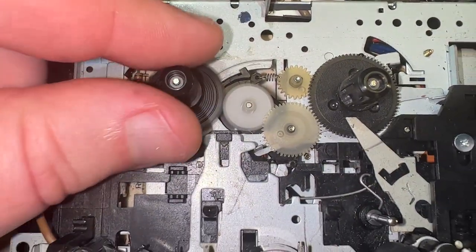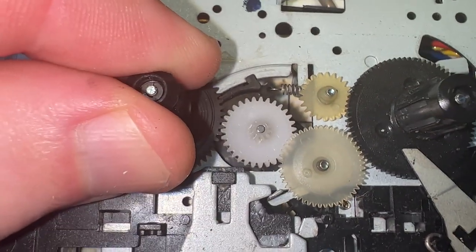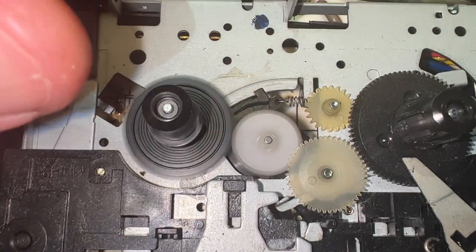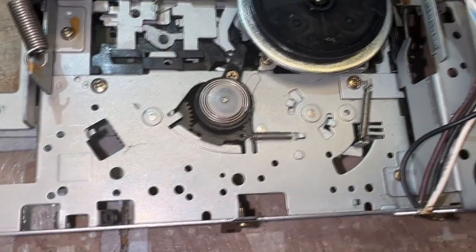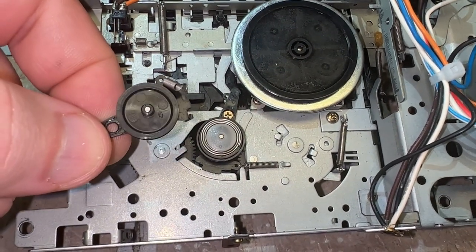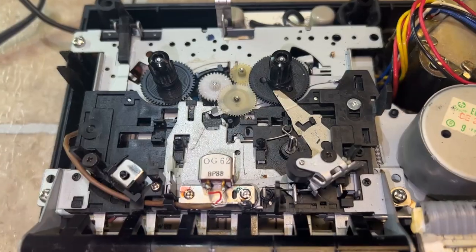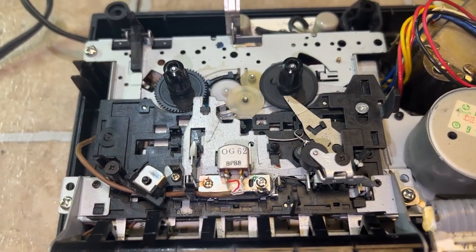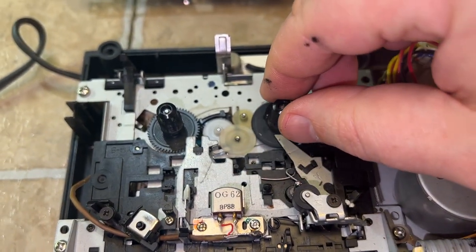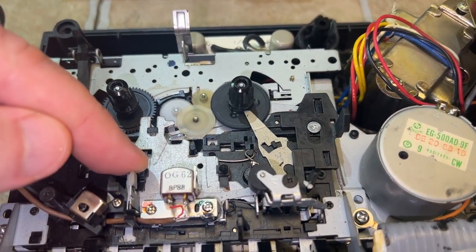Okay, now we're back to the A version, the regular auto stop mechanism, Tanashin. Also, if you observed right there when I stalled it, it was still spinning underneath the belt and everything. When I stalled it with that, see, that's the clutch on that one. I'm comparing the two. The clutch version has a spring on it like that. So you see that one actually has to go through the second belt to drive it. And if you stall it, see, that's the clutch underneath spinning. And you trip the auto stop like that.